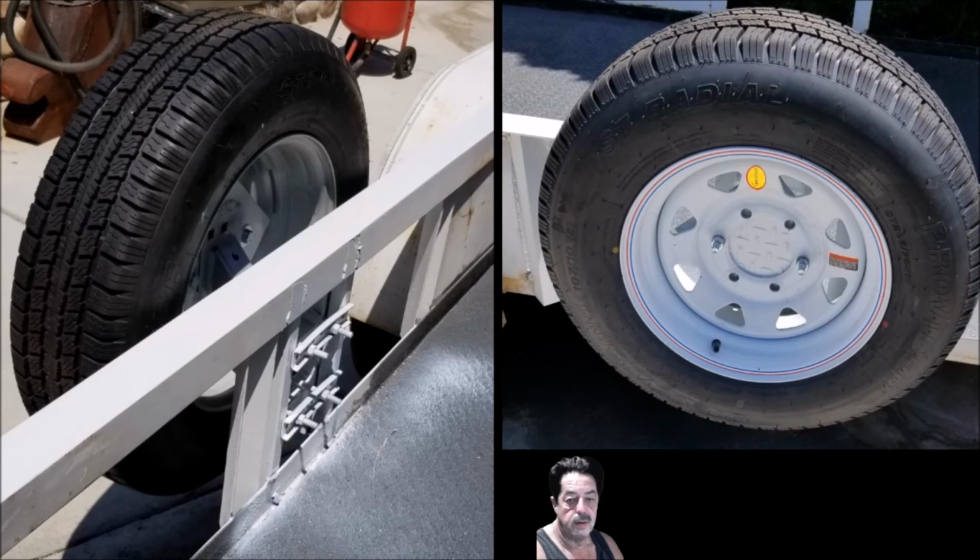The only thing I have to do is I have to go back in here, and with my 4.5-inch angle grinder, I have to take down all these weld marks that you see along the rail, and I've got to clean up the bottom along here. But the bottom, you'll see, has got its first coat of bed liner on there. We'll talk about that in the next video, but the overspray wasn't going to hurt anything, because I knew I had to go over everything again with another coat of bed liner, so I wasn't worried about the overspray. So we went ahead and we cleaned all of this up, and it looks like the picture on the upper left here, and everything turned out fine.